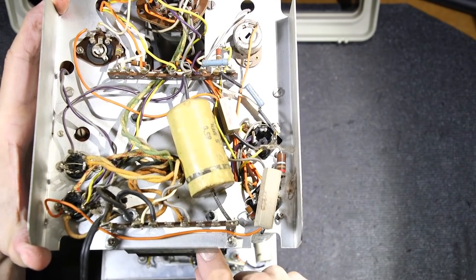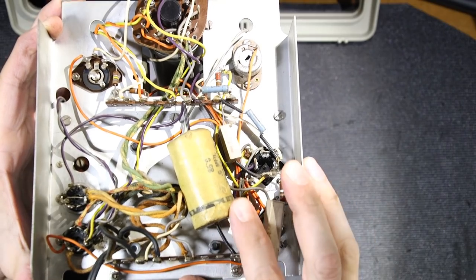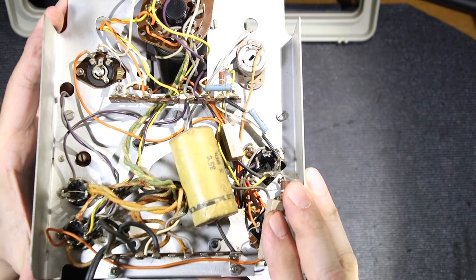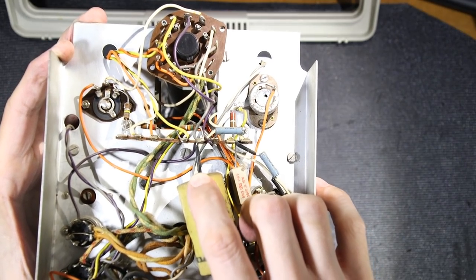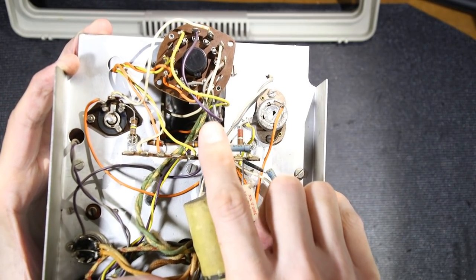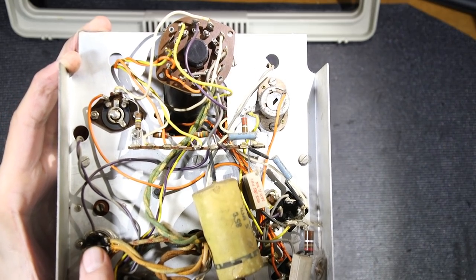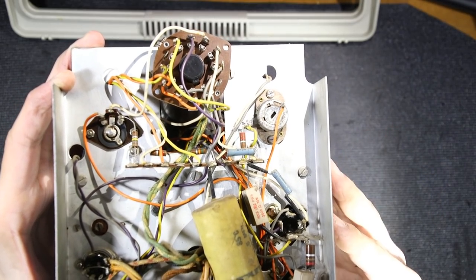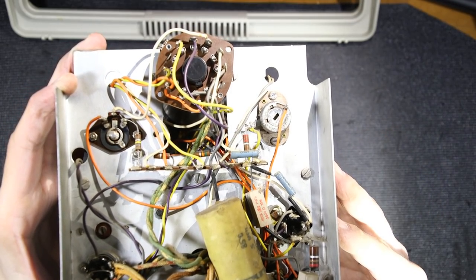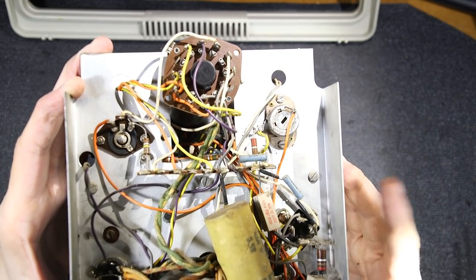So you see the chassis here, we have the band end here tied to the chassis. It's installed correctly, even though this is a negative supply. You can see up here, wire goes here, right to the CRT, and then if we follow the purple wire, it goes right to the high voltage rectifier. So I'm tempted just to plug this into my current limited variac supply and just bring it up slowly and see if I can get a trace on this thing.